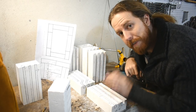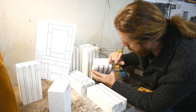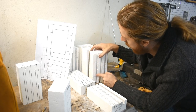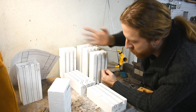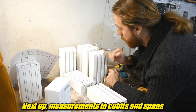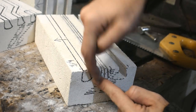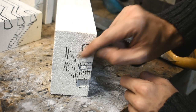These are just straight grooves. The way I separated everything was by five-eighths of an inch. This is a top brick, so five-eighths from the top to the top of the groove, five-eighths to the bottom of that groove, five-eighths to the top of the next groove, five-eighths to the bottom of the groove, and so on. You end up with one that's six-eighths — three quarters — because you have an eighth remainder. I put that on the bottom of this one. On the bottom bricks I put it on the top, and those are marked with arrows. The opening is three-eighths: the bottom of the groove is five-eighths down from the top. So I'm cutting one straight and one angled down, because I want that element to sit down in the groove, not just poked in.